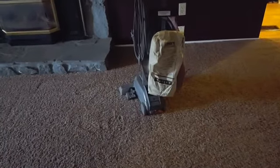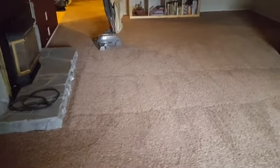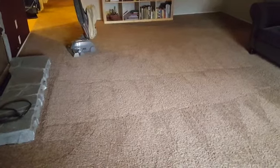That right there, that's what destroys carpeting. That's what causes all your wear patterns and things to set in. You notice how there aren't any wear patterns here? That's because we are pulling all that crud out of the carpeting before it can be walked on over and over again and leave wear patterns. That's how carpets wear out. Even the polypropylene carpets that are basically made out of recycled bottles, once they lose their resiliency, they ain't coming back up because they're pretty much dead. But you can prolong their life just by getting the oils and especially the dirt and sand and grit and all that stuff out of the carpeting with a good pre-vacuum. It just doubles their lifespan or triples or more.